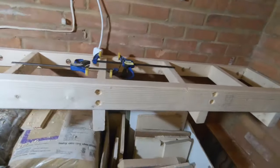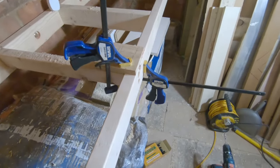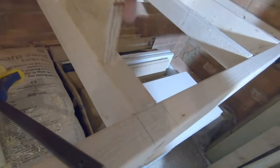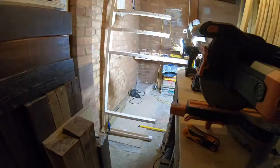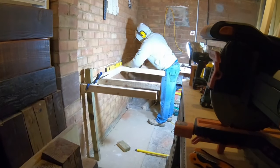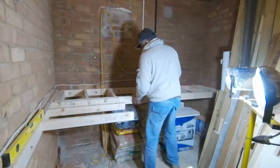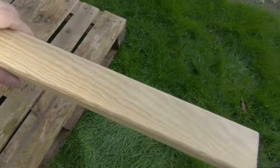Now I'm fixing the front part of the actual frame — it's the same construction as the back. The main thing to ensure is that it is perfectly level with no lip, and of course it helps if it is plumb. This section was built exactly like the previous one, completing the total L-frame. It's screwed in with anchor sleeve bolts and I made sure it is plumb. The flip-top section is beefed up so it goes straight into the wall and is rock-solid, and I'm doing a customary stress test.